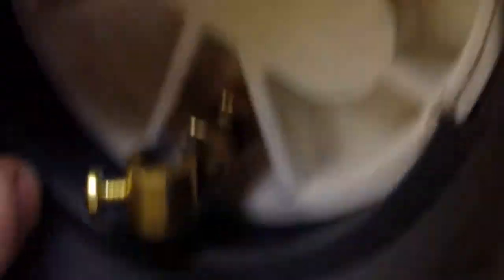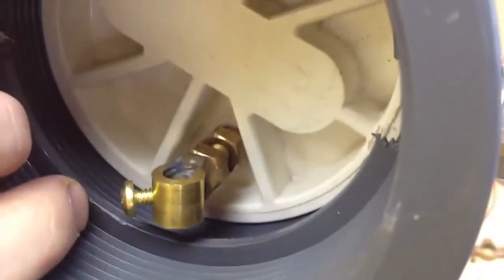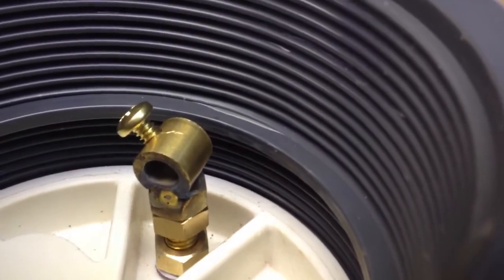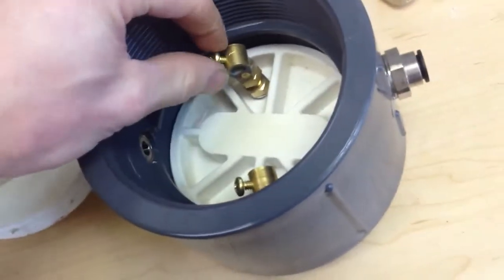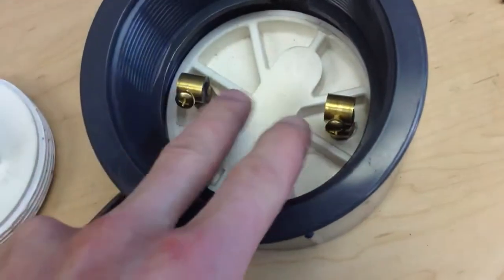What I've done is drilled a hole in the bottom and then tapped it out to get that bolt to fit in there. And then I've just got a brass bolt with two jam nuts — one on the bottom and one on the top. Then I TIG welded a nut to that fitting that I made to hold my piece. And then basically this is just a set screw right here, and I can put my two pieces in here and get them gapped just right.